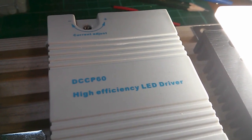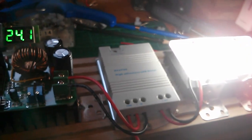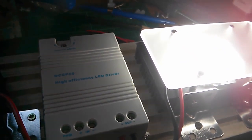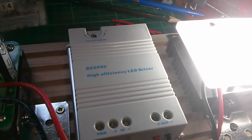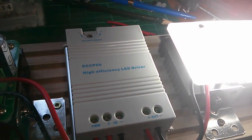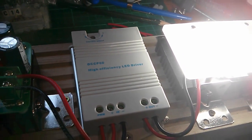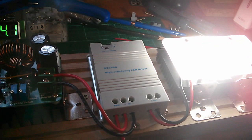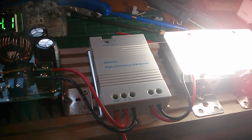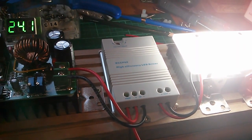There is also a 100 watt version of this LED driver. Since this setup works — pre-boosting 12 volts to 24 — I might get the 100 watt version and the 100 watt LED and do some experiments with pulse width modulation. For the moment, that's the end of this experiment. I'll do a follow-up with more on PWM, and in particular interfacing an Arduino for brightness control.